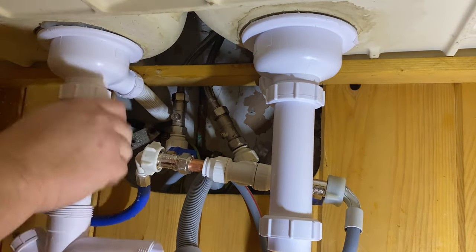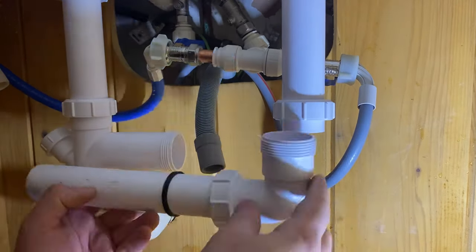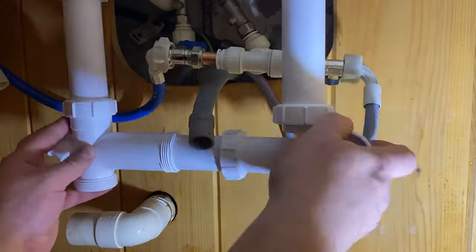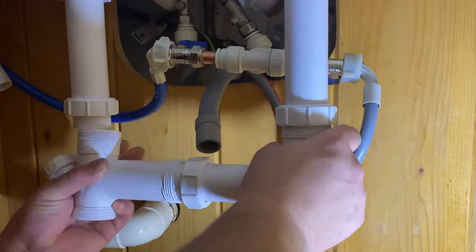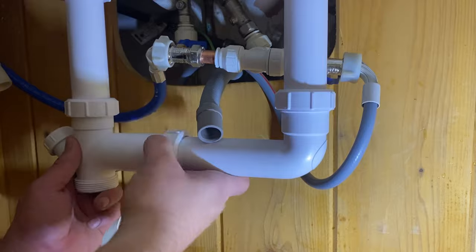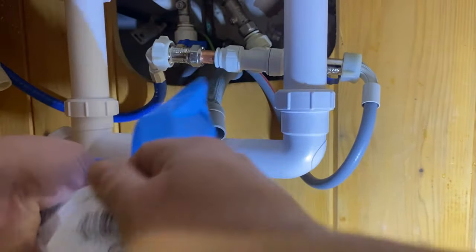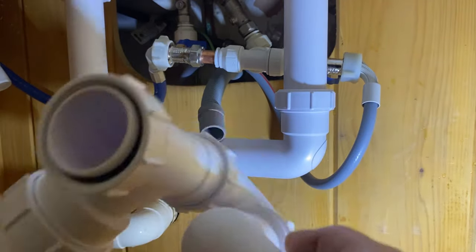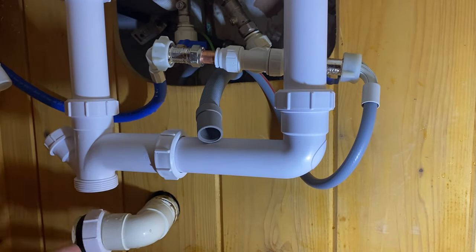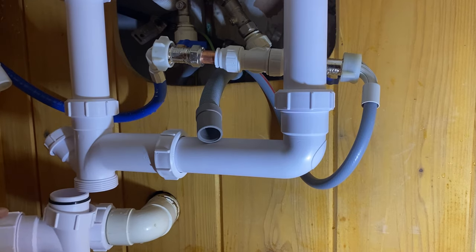There are some rubber rings that go up inside and they're flat — not chamfered, just flat. You can cut these down to size to make sure you've got your distance right, then put those on. This is only temporary; we just need to see where exactly the levels of everything need to be. We're probably going to cut those two tails from the basket strainers down so that the trap is at the right height. We're looking at the lowest point possible to see whether or not it will fit — and it's kind of close.